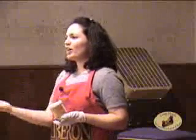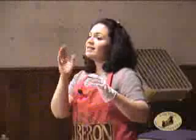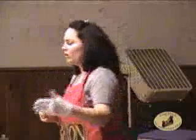I guess I've always used 1 pound bags, so I've never really had to think about that because we sell 1 pound bags, 5 pound bags, stuff like that. But in general, the cut is what's important, and people usually don't understand what that means. So you want to try to have 3 pounds of shellac to 1 gallon, and denatured alcohol is what you need. You can use regular alcohol, but denatured is a little better.